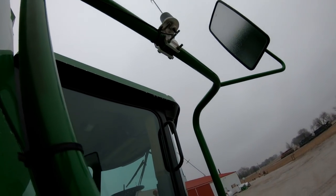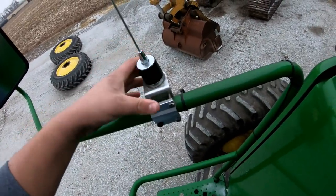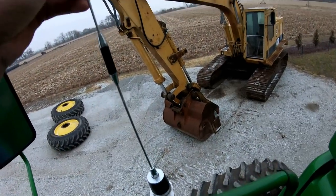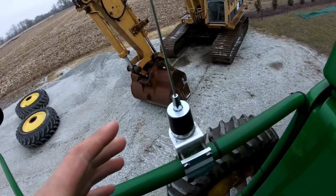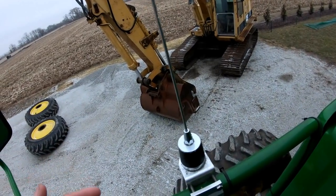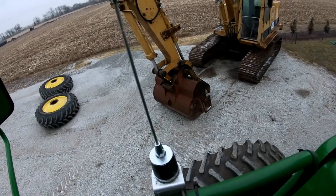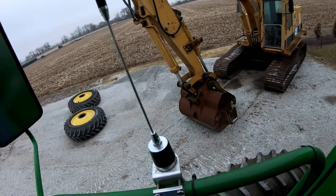So I'm up here on the platform. The clamp I used to mount the antenna — this is actually the 6 dB antenna. You can see there's a couple of corn whiskers still wrapped around it. I wouldn't recommend this as being the ideal antenna spot as far as reception goes. We can get 25 to 30 mile range with this antenna mounted in this spot, though I haven't tested it farther than that because that's as far apart as our farms have gotten — from Stark County clear over by our farms in Wanataw.